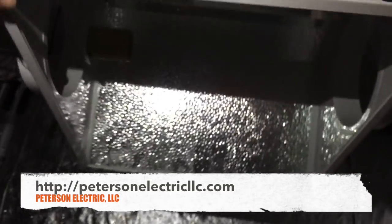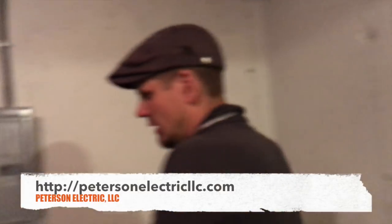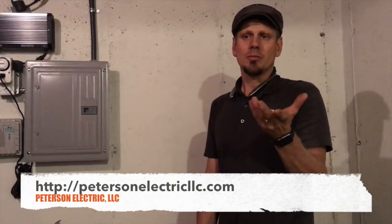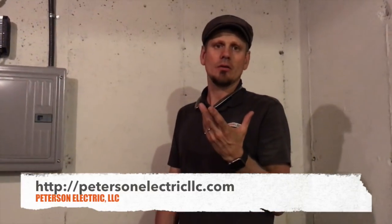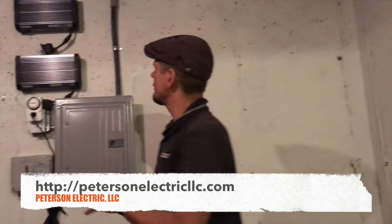That ballast is a pretty fancy unit. These are 1,000-watt metal halides that'll screw right in. If you can go LED, I've heard Lush is a really good brand — you're going to pay a lot for those, but with LED you can manipulate the color rendering. High pressure sodium runs warmer, around 2,500 to 3,000 Kelvin, while metal halide runs brighter up to about 3,800 to 4,000 Kelvin.